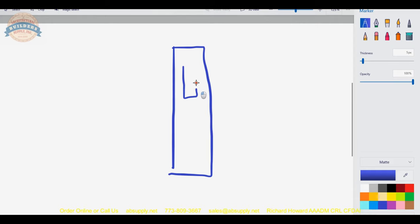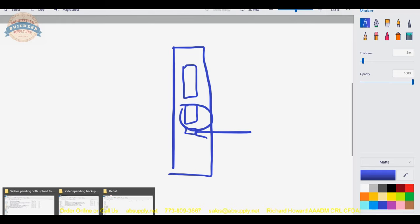On a keyed function you could have your deadbolt, your latch, and a small auxiliary latch. When the door is closed, the auxiliary latch is held within the lock case, preventing the latch bolt from being loided or tampered with — it basically locks the latch bolt down. That is of course a requirement in a fire-rated scenario on keyed locks, and this principle is found very commonly on fire-rated exit devices.